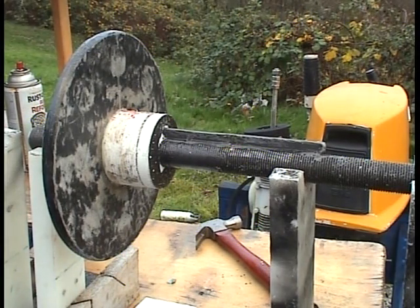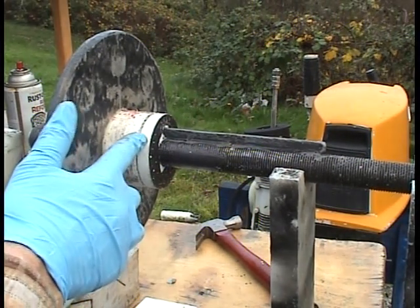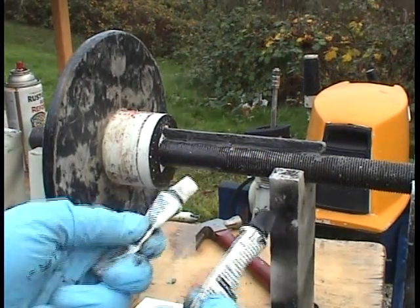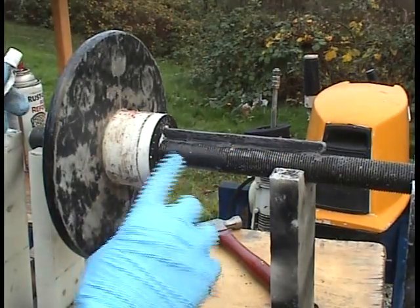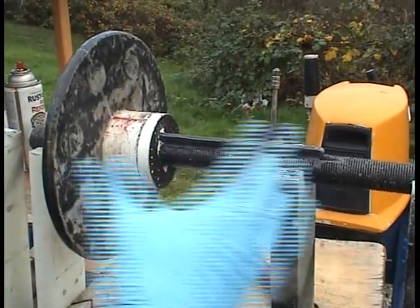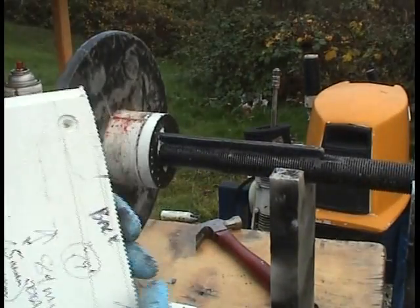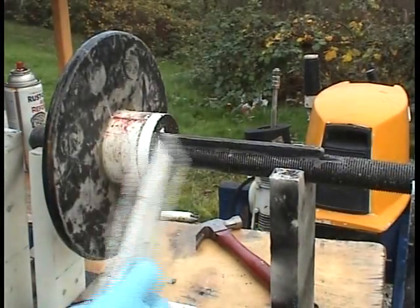Okay, I took apart the 3 rotors and just have 1 on there now. This one's good, straight, everything's good with this. I put a shim here. And also, I took some JB Weld, the 5-minute type, and smeared it on here, and also here. And I had put this together already. And I cut these 84 millimeters across. That's giving it 79 millimeters tight.